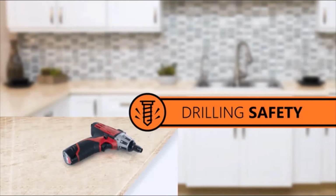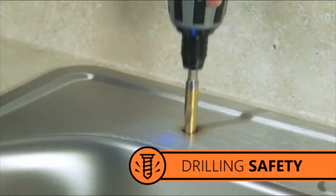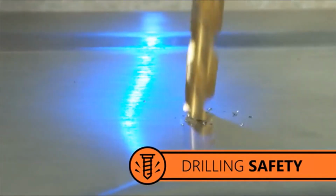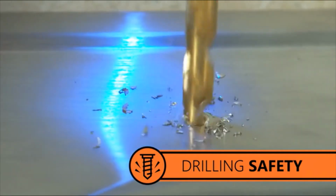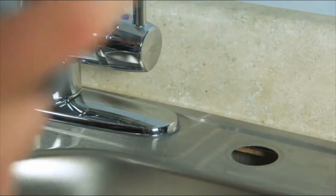Use the proper drill bit and drilling method for the material you're drilling. Porcelain or granite may need special drill bits. First, find a good location for your RO faucet. Any flat surface where drilling a hole will not damage pipes or wiring will work. Use your power drill and 1/2-inch drill bit to make a hole for your RO faucet. You can also use an existing hole of the appropriate size.